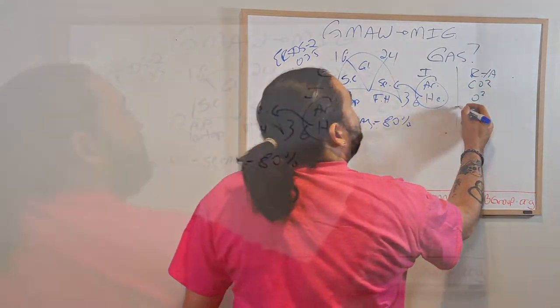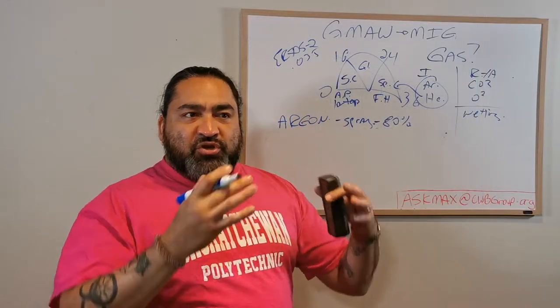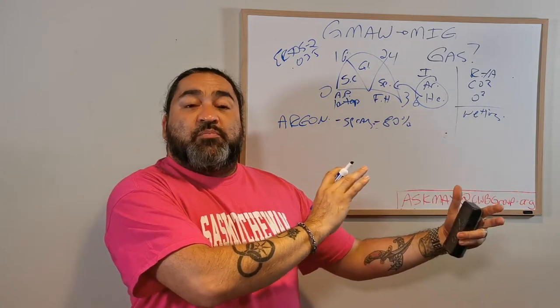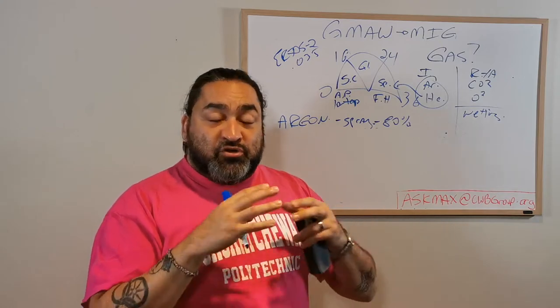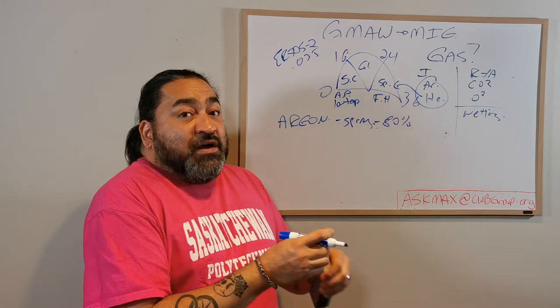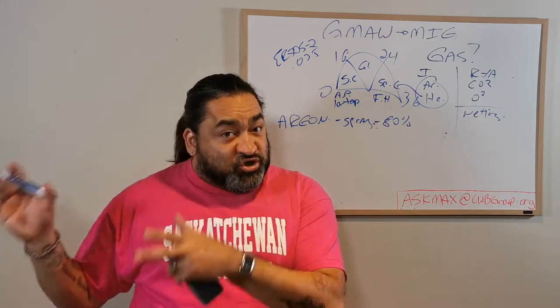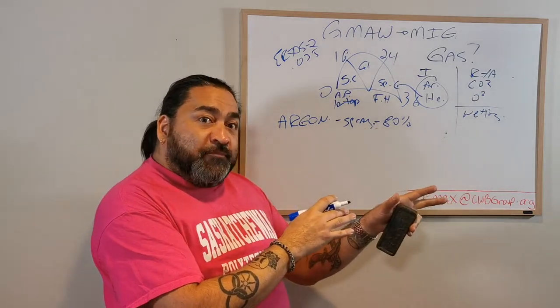Well, we talked about its benefits. It's good for wetting, which means that the edges will blend easier. Where it interacts with the unwelded plate versus the welded plate, that barrier is smoother and the transition is cleaner. So that's nice, right? It helps jack up the heat of the puddle at the point of the puddle, which is nice because then you're not putting the stress on your machine. The gas itself is contributing to the heat input.